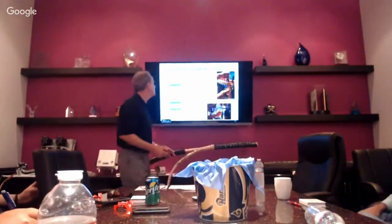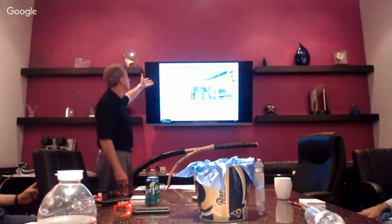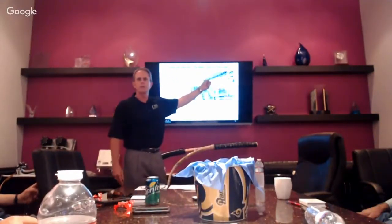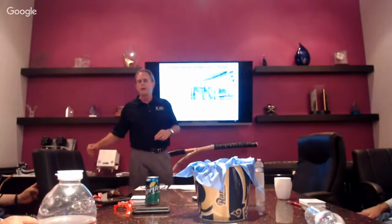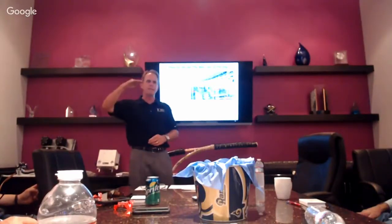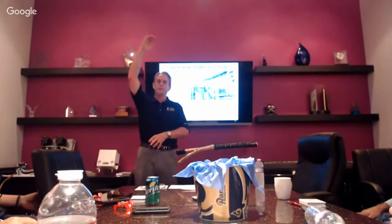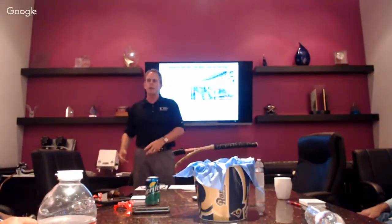So the walk-in cooler. Go back to that other. There we go. So this is a typical cooler, and these have beer pumps, and this is set up kind of wrong. One of the things with beer pumps is you have to put straight CO2 on the keg at a pressure that will drive the beer out of the keg up to the pumps. And that lift is about 5 feet, maybe 6 feet, before you start having to put so much pressure on the keg that you're overcarbonating it to get it up to 8 feet. That extra 2 feet is a big deal. So now you're putting too much CO2 pressure on the keg, and you're going to start having foaming issues.